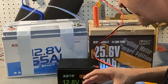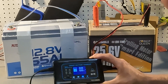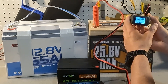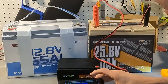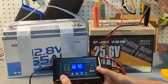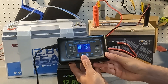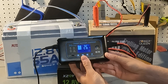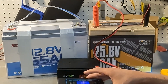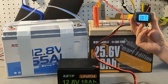Switching to the 5 and 10 amp setting on 24 volts — we should get a 5 amp charge. The display shows 4.9 amps, and the clamp meter shows 5.05 amps, so we're getting right what the switch tells us. Now the highest setting, which should give 10 amps: the display shows 27.1 volts and 8.7 amps, while the clamp meter shows 8.1 amps.